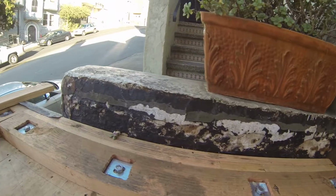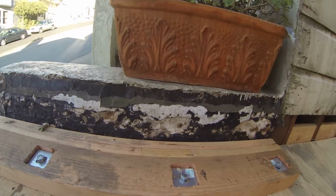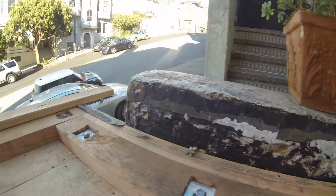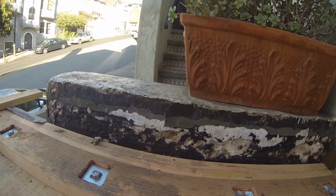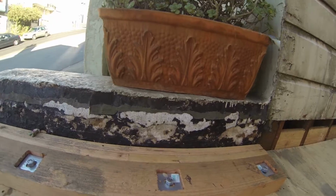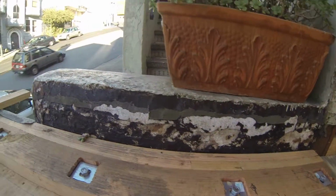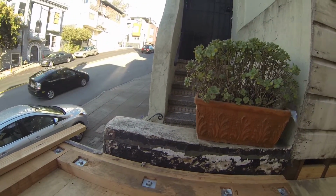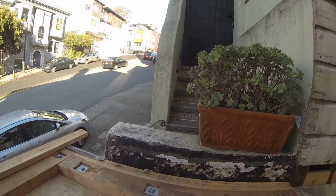It's kind of lumpy looking. I'm thinking you might take some Ardex and smooth it out a little bit. I don't know how well it's going to stay, but that's another approach to even out this wall. And the only other approach I have is to have them come in and put some cement board or something on here. So that's a detail we're going to have to think about and work out. This, by the way, from this wall over is not our property, it's the neighbors', so we don't want to do anything that looks clunky, kludgy, all that kind of stuff.